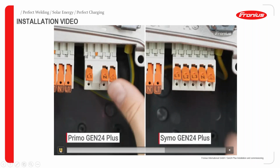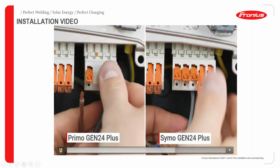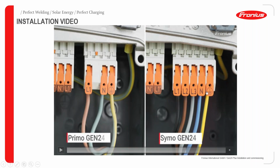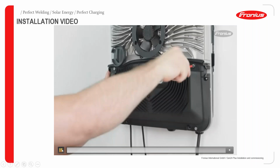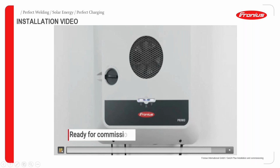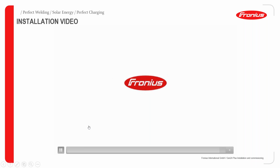Next thing to do is to connect the AC cables. For the Primo, you will need just 3 cables: the live, your neutral, and your ground. And for the Symo, you're going to need 4 cables. So the 3 phases L1, L2, and L3, and the neutral, and of course your ground. For the Primo, you just need 3 cables: live, neutral, and ground. Okay, let's continue. Afterwards, you cover, slot in the DATCOM cover, and then screw the 180 locking screws. Afterwards, you screw in the 2 locks for the inverter cover. After that, you switch on the inverter, and the installation is done, and your inverter is ready for commissioning.